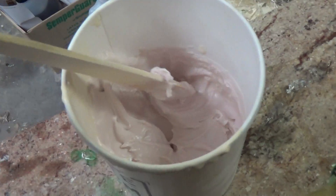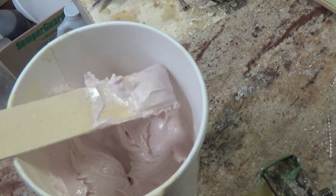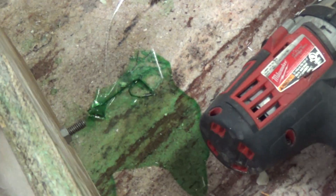Here's the trick I was talking about. You mix up micro balloons with your resin — it's a little like peanut butter — and then you put them right here in the sharp corners. Wherever you have sharp corners and you don't want bubbles — you don't want bubbles anywhere — you just roughly put it in there and spread it in. Hopefully you don't have any bubbles. I'll do this to any area where the glass would have a hard time bridging without producing a bubble.